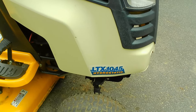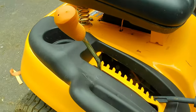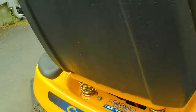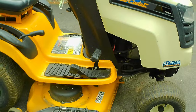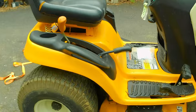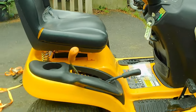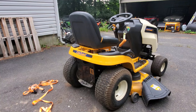The 1050 has an electric PTO so that'll be totally different, but probably an LTX 1040, 1045, 1046 - any of these 1000-series LTX's with a lever like that should all be about the same. It listed a whole lot of these when I looked up the cable. I'll try to put a link for the cable - I got it on Amazon. You don't even need to take the deck off. It took me about 15 minutes - I struggled a little bit, but I think I did it the hard way. If you connect it to the lever first and then to the deck tensioner, that would actually be the easier way. If this video helps anyone, please like and subscribe.